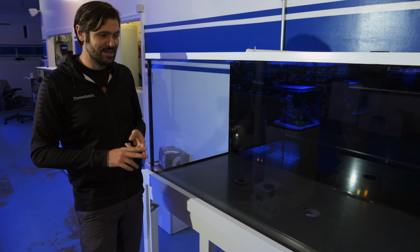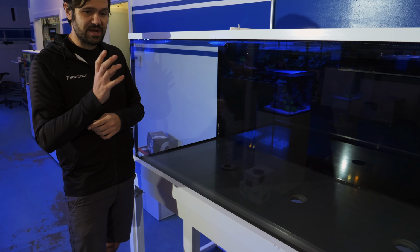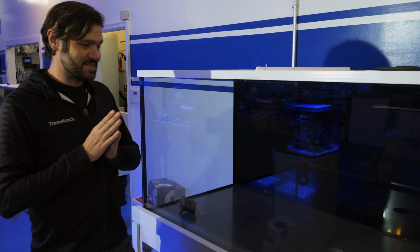but I want to pass a lot more volume through it. So what we did in a previous video is we enlarged all the holes for a 1.5-inch bulkhead, this one right here. And you'll see the reason it was routed is so that it would fit this gasket perfectly here, right? So because it fits perfectly in this hole, when the bulkhead comes down on it, it's not gonna flatten out. It's just gonna be completely contained and compressed here. So this is gonna be one of the most solid parts of this build.